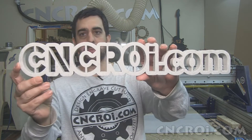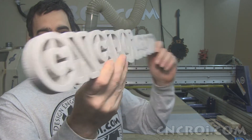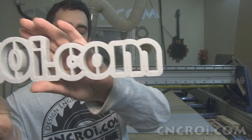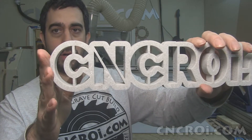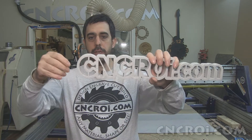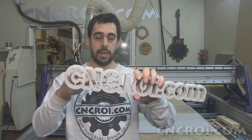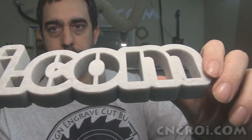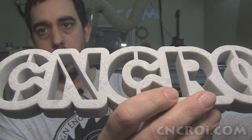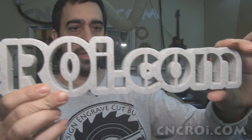In this case here, this is my website, CNCRI.com. It's made out of stone which is three-quarter inch thick. This is done with a waterjet, and the nice thing about the waterjet is that you cut this material really, really easily and really well because it's an abrasive process. Abrasive is basically just water and sand, and what it does is just wears the material out. The nice thing about that is that it actually sands the surface as you're doing it, so everything is nice and clean. The reason for these supports here is to give added strength to the overall design.